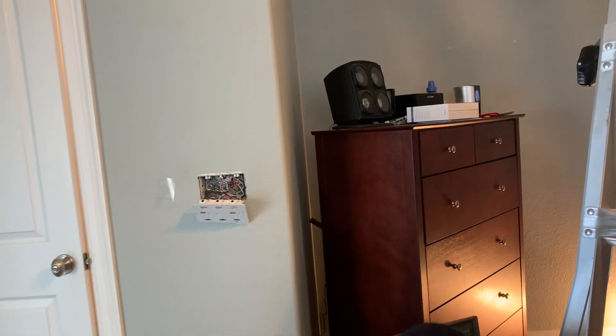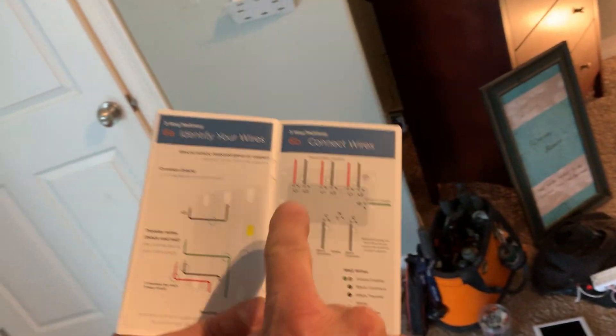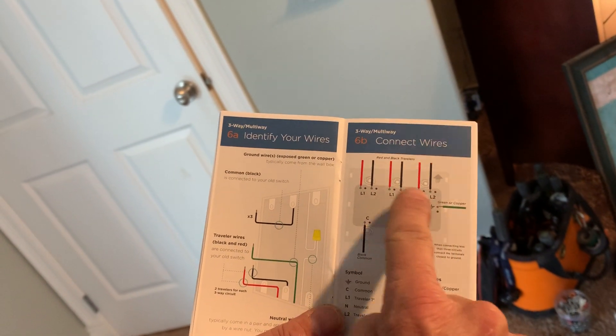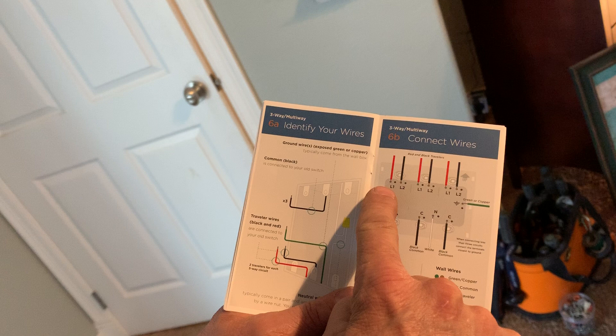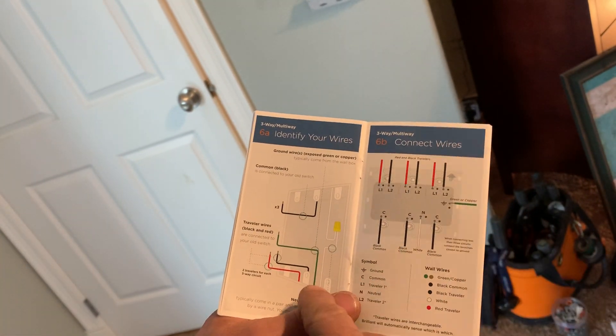You have to keep in mind when they're telling you to wire this, you actually have to wire all three lines — L1, L1, L1 — as a parallel. L2 is only if you're going to have a three-way and you kill the other side.